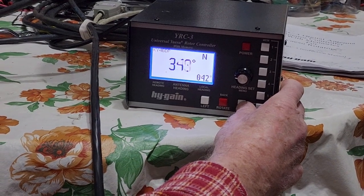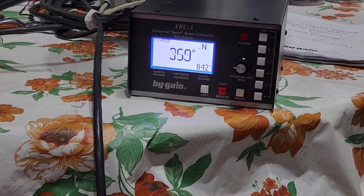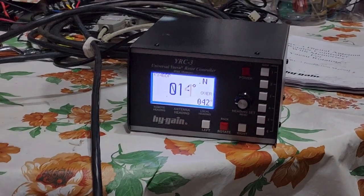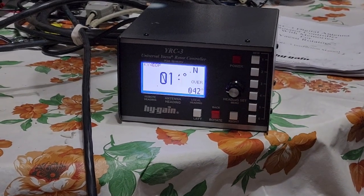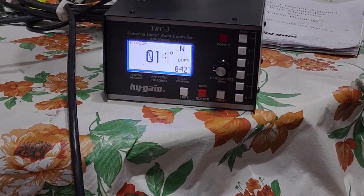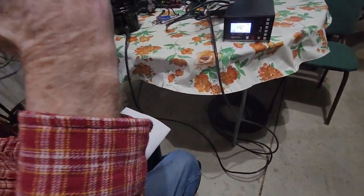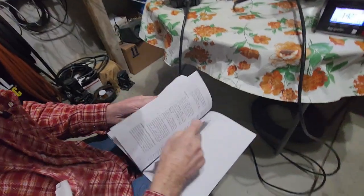We discuss the rotor's overlap feature — it's theoretically 360 degrees, but this has an overlap, so you can actually continue on past north. It says 'over' because you've gone beyond that point. You can go 13 to 14 degrees beyond north, and that's when the right-hand stop engages. There's also a coast feature: the controller shuts off 20 to 30 degrees before the stop and then coasts in, because if you have antennas there, their centrifugal weight and inertia will pull you on over.